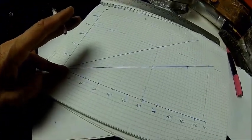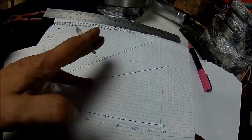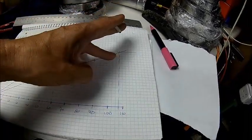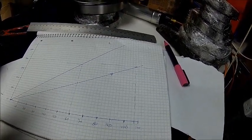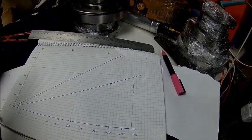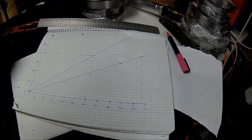So if we follow this voltage-frequency curve at full load, the motor will draw 4.8 amps, no more — so we're not overloading the motor even if we want double the frequency and roughly double the power. Because the torque stays the same and the speed is double — that gives us double the power. Simple as that.